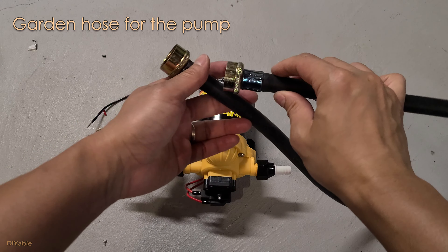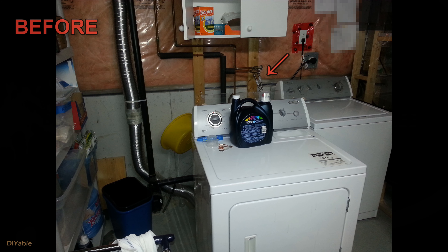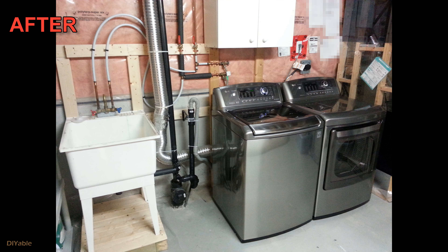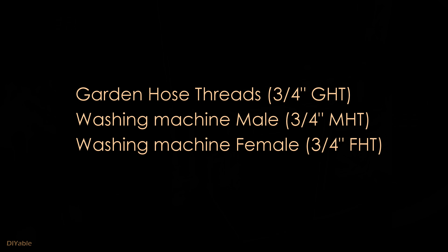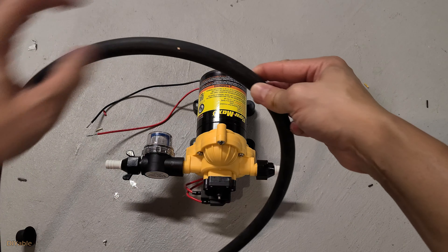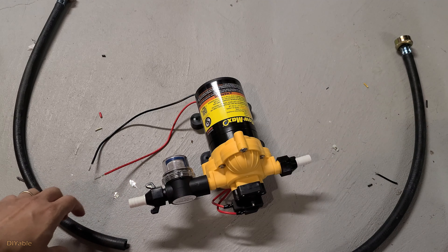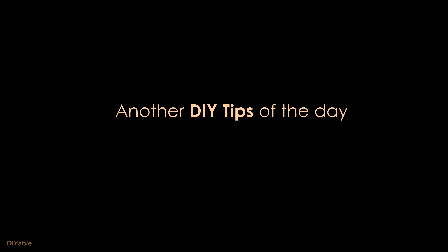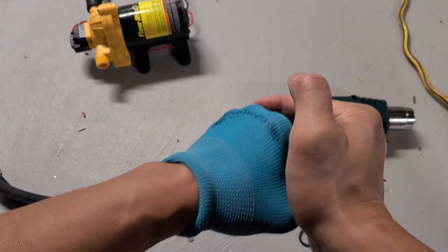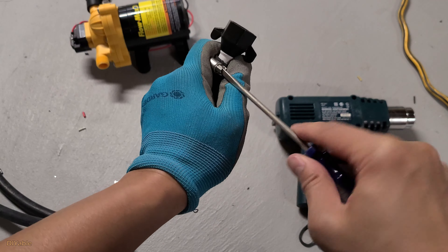Let's talk about the garden hose for your pump. If you have bought a new washing machine and did not replace the old water hose, you are in luck — you should have an extra pair that came with the new machine. Garden hose and washing machine hose are compatible; not many people know about that. You can chop this into two pieces. You may have a hard time pushing it into the barb connector — just heat the rubber hose with a heat gun, then you can push it in. Clamp it down using an adjustable clamp and we are good to go.